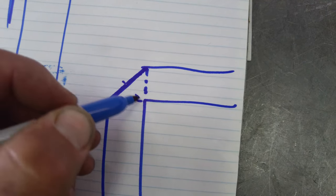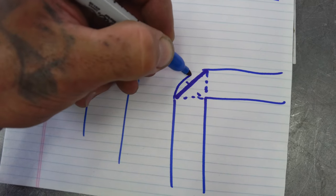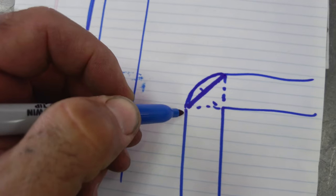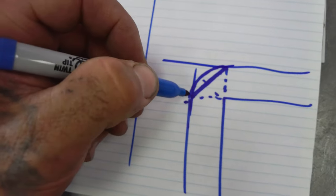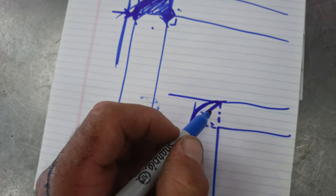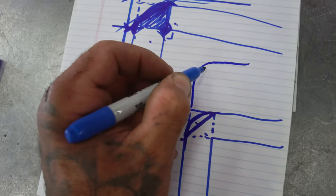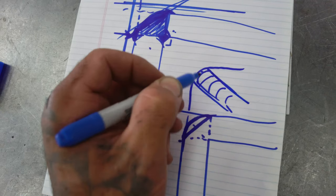Now, your weld could still be stronger. So then you come in with your cover and you can crest this thing and ensure that everything's completely tied together. It's either a little above the surfaces here, or just right tangent with them. A lot of the heavy pro dudes will have that perfectly capped kind of weld going on, you know? So that's something to think about.